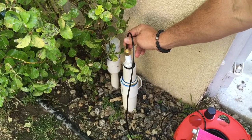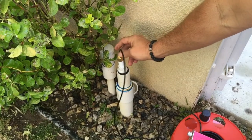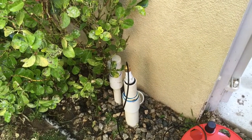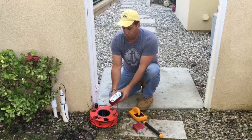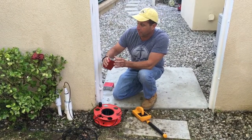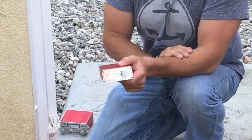That's the actual sound that you're going to hear when you're over the leak. Because the microphone head is right next to a very slow pressure-side leak, this is the classic sound that you're going to hear from that. Now that we found it with the amp, we're going to disconnect the amp. This is the flash driver, and what this does is it puts out a steady or a pulse sound.